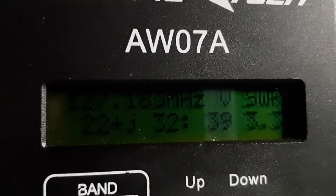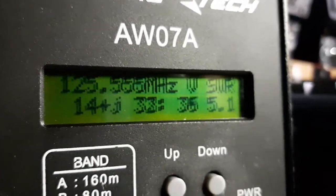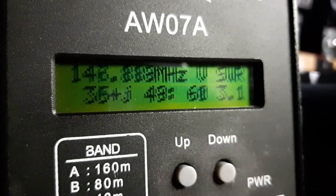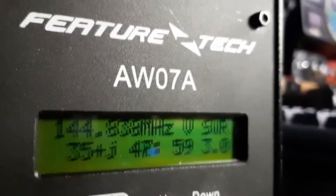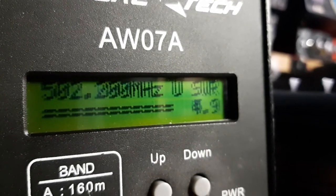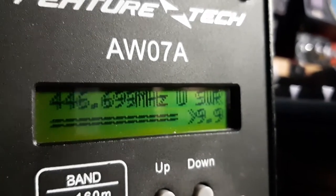At 125 MHz it's SWR 5.2. This is the Nagoya. Let's go up to the 2 metre band and see what it's got to say for itself. It's better than it was on the other analyzer for some reason, but I've got an enormous number of adapters in here which won't help. On the 2 metre band we've got an SWR of 3, which is pretty rubbish. On 70 centimetres — not even a hint of resonance, all the way up to 500 MHz. Rubbish!